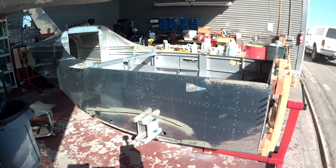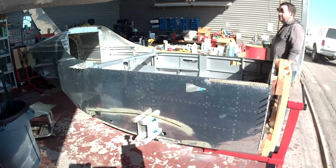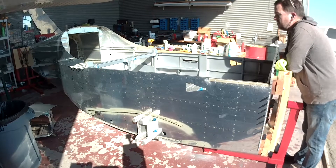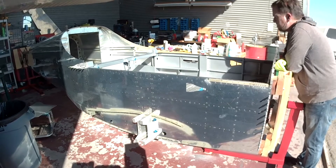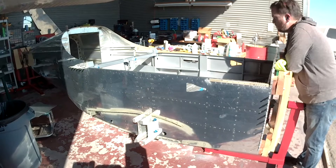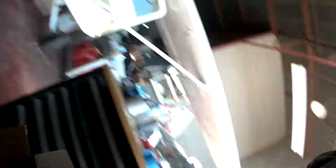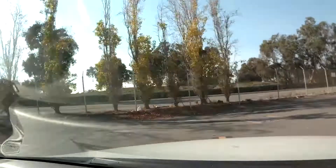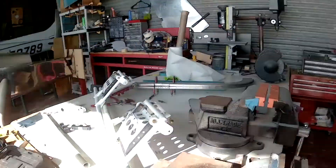I think I do have some video of it, but it'll be next time maybe. This is one of those weird things where you paint, and then you have to wait like a day. Because I'm using all enamel — enamel primer and paint. I want a hard coating on everything, but it takes two to three days for it to properly set up and cure. There I am staring at my handiwork. Then you've got to go back and sand down any high spots, or if you accidentally have any orange peeling, or you put on too much and it's drooping. So you've got to sand that off, then clean that off with rubbing alcohol — which is why it needs to be cured, because it'll just rub off if it's not. And then once that's done, you can put on a second coat.